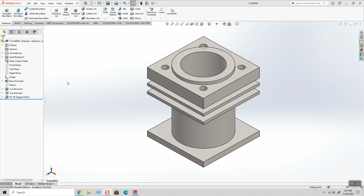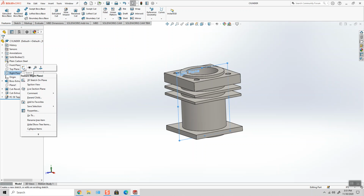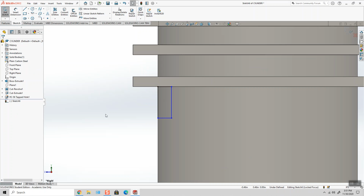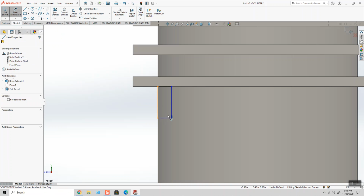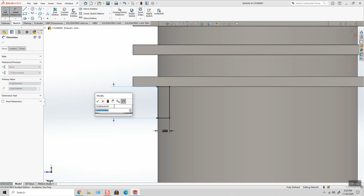Next, I'm going to make a 35 thousandths flat. It says 0.035 flat with end mill on this surface here, and I'm going to sketch it on the right plane instead and show you why I prefer this method. So I just anchored the rectangle in the corner as shown. It said it was 35 thousandths flat, which means this dimension is 0.035. That's the depth. Let me change that. And the width is going to be 0.125.